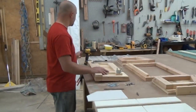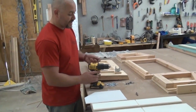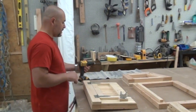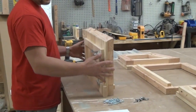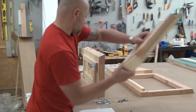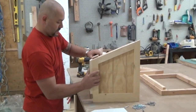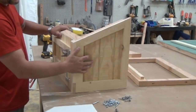Let's go ahead and get started. The first thing you want to do is grab your number two square head bit, put that in your screw gun, and then grab your back wall. Stand that up. In this case we're going to start with the right wall of the egg hutch, and that's going to slide right onto the side like that.